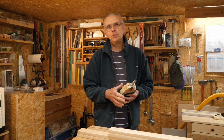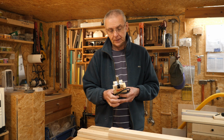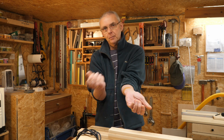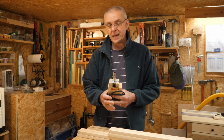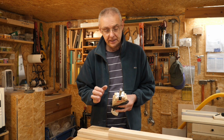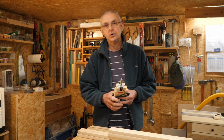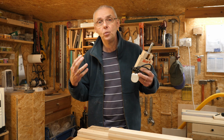Hello there. Now I want to give you the benefit of hindsight, and that is, in this video, I've been using this hot bending iron, and I've managed to burn both my arms. So if you're going to use one of these bending irons, this is my homemade one, but you can buy them, they get very hot indeed. So make sure you wear the right gloves first of all. I always do that. But also when you finish bending the wood, turn the iron off and move it completely away from the area where you're working.